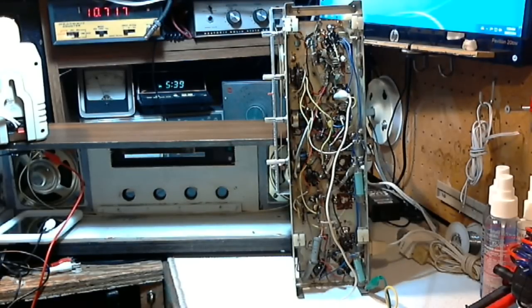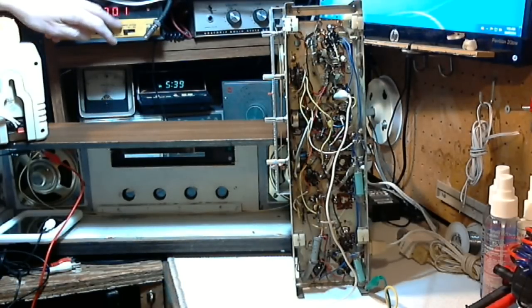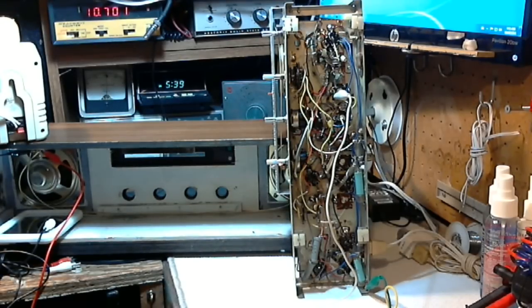I really just want to adjust the IF strip for the AM and FM side. I already have all the equipment set up and everything's running. First I'll flip it up to full voltage — I just noticed I was on restriction. I have the frequency set to 10.7 MHz. My frequency counter is only so accurate, plus or minus 0.005 or so, but that looks pretty good.